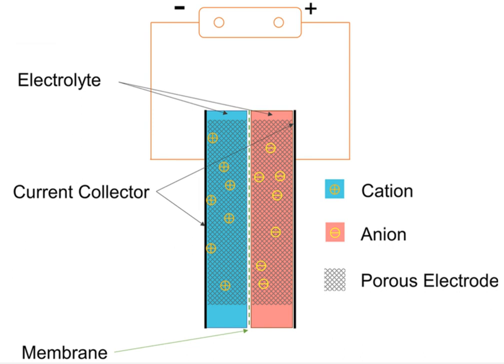Voltage stabilizer. Supercapacitors can stabilize voltage for power lines. Wind and photovoltaic systems exhibit fluctuating supply evoked by gusting or clouds that supercapacitors can buffer within milliseconds. This helps stabilize grid voltage and frequency, balance supply and demand of power and manage real or reactive power.